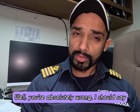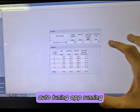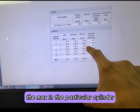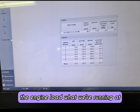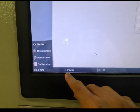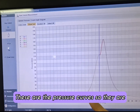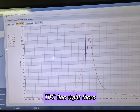What do you think the function of these online sensors is — just to measure the pressure inside the cylinder? Well, you're absolutely wrong. This is the PMI computer with the PMI auto-tuning app running. The online sensors help us read the compression pressure and the maximum pressure in each cylinder. After that, it calculates and gives us the engine power and the engine load we're running at — for example, right now we are at about 61% engine load, 9,200 kilowatt at 80 RPM. When you go to the balance view, it tells you whether the engine is evenly balanced, showing pressure curves superimposed on each other relative to your TDC line.